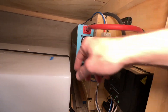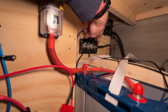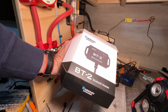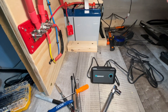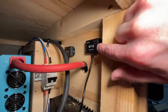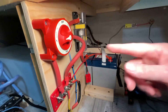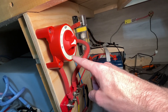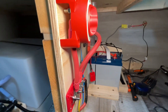I've connected the ground and torqued the two terminals to 16 newton meters. The ground wire is connected to the negative terminal bus, which is connected to the chassis ground of the camper. Now I'm going to connect the remote and the BT2 Bluetooth module to link it to the Renogy One Core, and then we should be ready to test. I turn on the battery disconnect for solar plus RV, which powers almost everything — and I'll switch it to power the inverter.